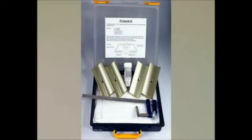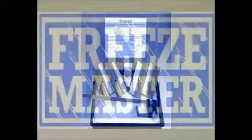The 690 upgrade kit is supplied with 4 adapters, freeze cream, towels and a long clamp, and enables the 690E machine to freeze a 2.5-inch and a 3-inch iron pipe, which have an outside diameter of 76 and 88mm.